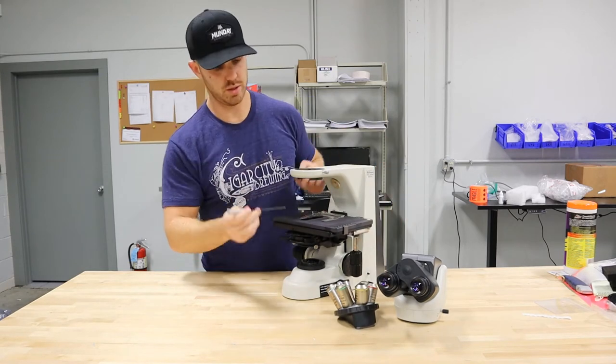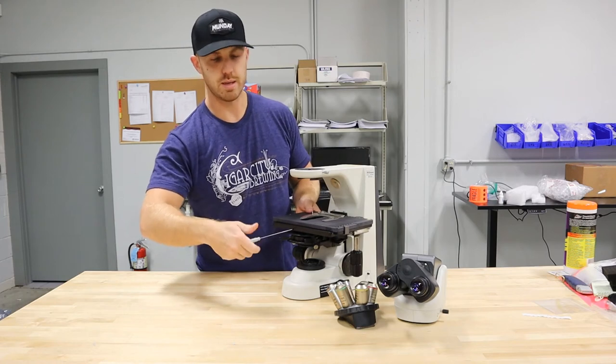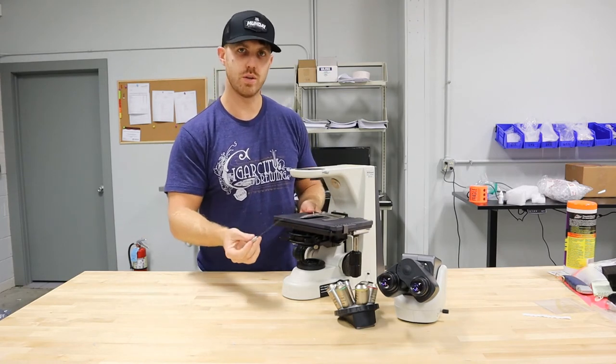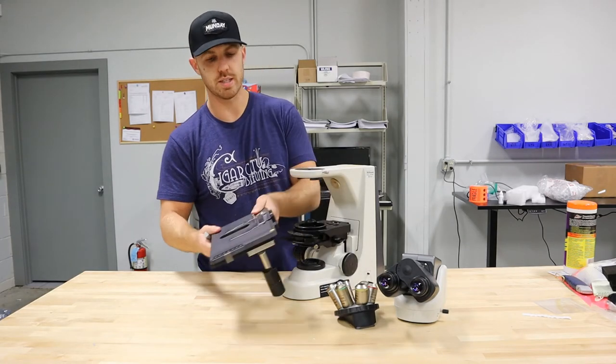The stage — same wrench — it's going to go in this front hole here. Sometimes Nikon will have a knurled screw that you can use; other times it's going to have the two millimeter Allen wrench that's built in. That's going to come off.